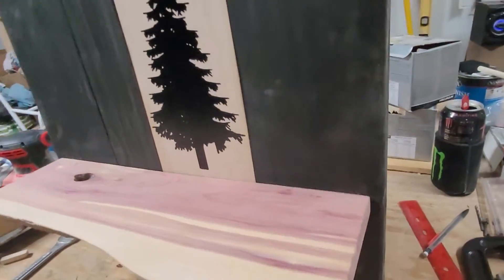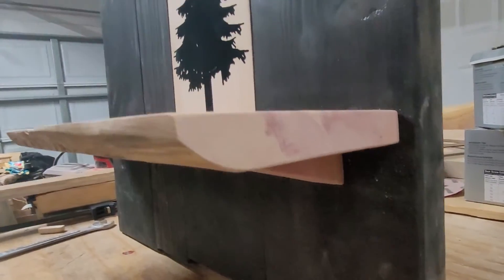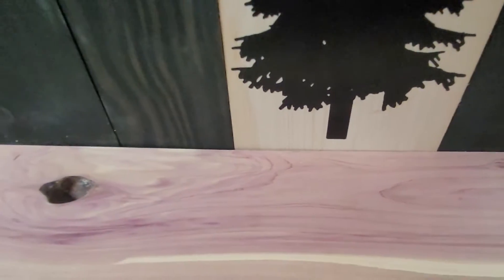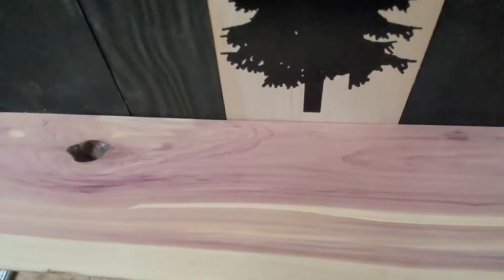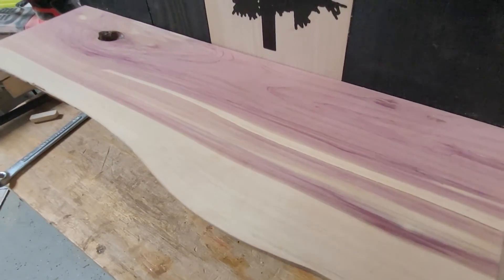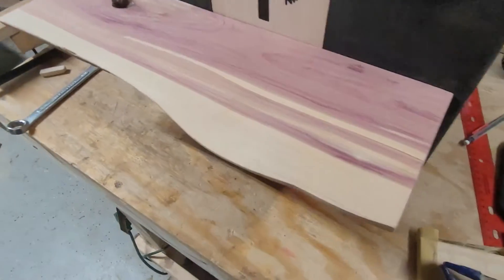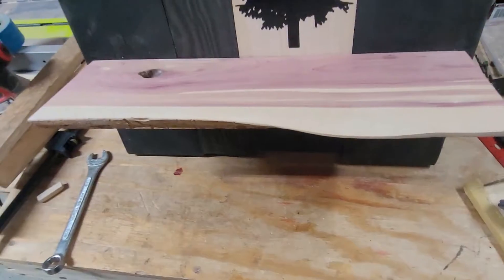All right, shelf is attached. Supports are glued to the shelf and to the backboards. I did not glue the shelf to the backboards itself because with four different backboards and five screws in it, I'm worried about the different woods contracting and expanding at different rates and warping the shelf — that'd be a quick way to ruin it. It's not going to hold a crap load of weight, but it will hold anything you might put up there if it's in an entryway — wallet, cell phone, that kind of thing.